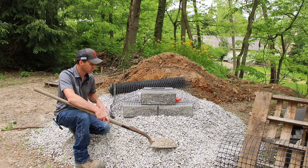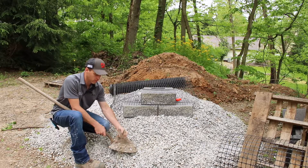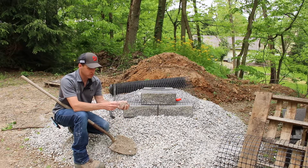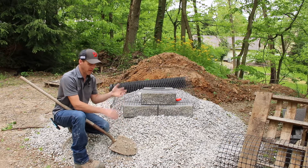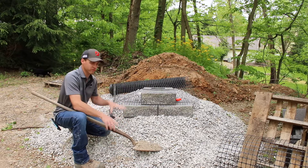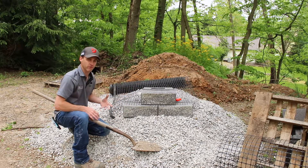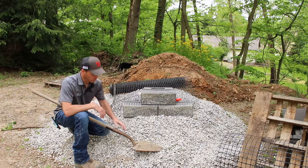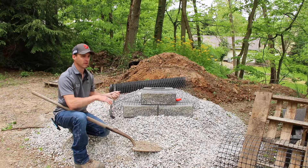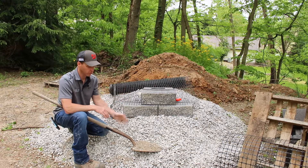It's just kind of a brief overview. You can also use dense graded material for your base — it's got the three-quarter stone in it plus fines, and it requires a lot of compaction effort. You'll need to get that in on top of your compacted subsoils. Ideally you also want to put in a geofabric or woven geotextile to separate the base from your soil, and you'll need a compactor to compact this dense graded base very thoroughly.